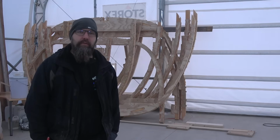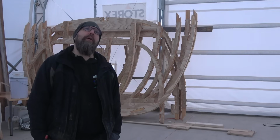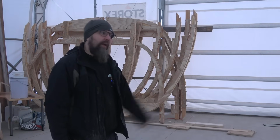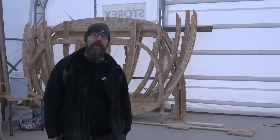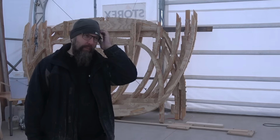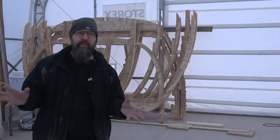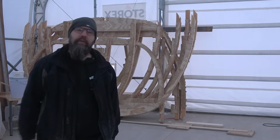All right, after a week or so of pondering, I've come to the conclusion that I will go with option number 1, this one, with the plywood pieces with the adjustable bolts on them. There is really one reason why I eventually decided to do that, and that is that I can adjust them later. Probably I would have been able to do the planing well enough, but when the environment changes a little bit all the time, moisture levels go up and down, and temperatures, etc., I think the adjustability is a good thing to have there.